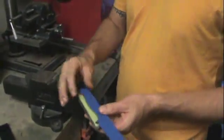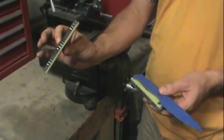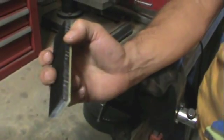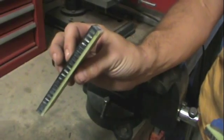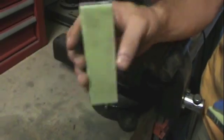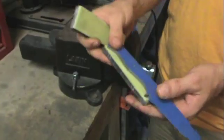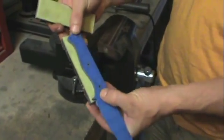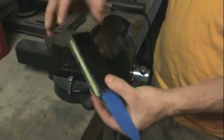First thing we're going to do, which I know I didn't show in the video, is that this is a two-part handle scale. I epoxied on the Moon Glow to the C-Tech. It's a new material I'm going to try out. I haven't tested it before, but we'll see. I didn't show the epoxying because it's the same process as epoxying it onto the knife itself. Whenever you're doing that, make sure you've got good clearance on both sides of the knife, with extra scale material on both sides.